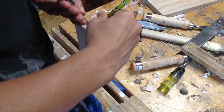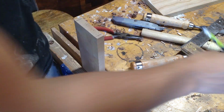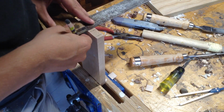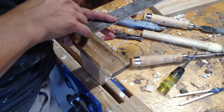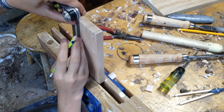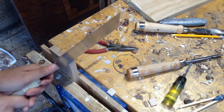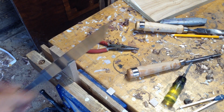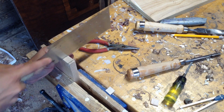So then this is the same exact process. I'm using those calipers. You're getting the calipers to meet your marks perfectly, and then you're making them slightly wider in order to get the equal spacing going off of both edges. And then this I'm going to go through very quickly because it's the exact same process, making these tails on the same end and then cutting them down.